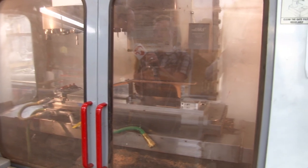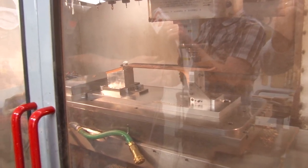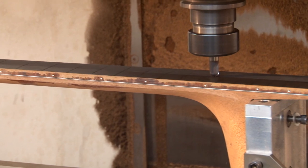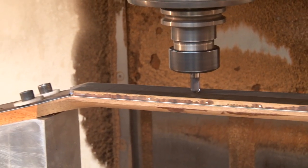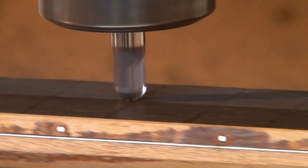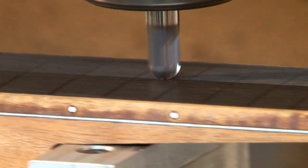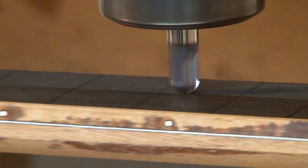We have two CNC machines and one gantry. The CNC gantry cuts the outside profile and puts in the sound holes — they're time savers, not a skill thing. The other machine is used mainly to cut out the bracing and shape our bridges. However, since the machine wasn't being used every day due to our small numbers, I asked our machinist to create a fixture and program to do fret work — putting a radius on the ebony fingerboard. It's not doing the final version, just rough sanding down to save about 45 minutes of labor while the guys do something else.